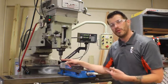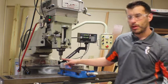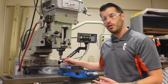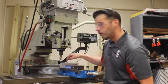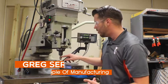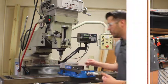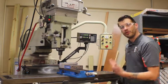These shapes determine how we're going to cut our metal. This is an end mill — it doesn't cut with the bottom, it cuts with the periphery, the sides. Whenever you push a drill bit into material, all of your cutting forces come to the point of that drill. On this one, we're using the periphery. Getting used to your axes, depending on the direction you go, it's going to throw your chips in a different direction.